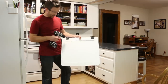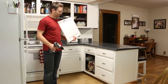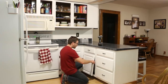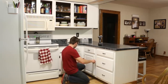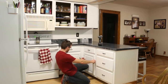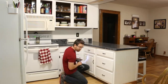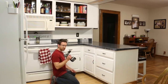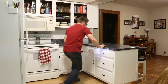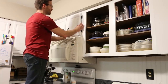Now we're putting on our cabinet doors. Mount the brackets to the door — luckily I was able to use the previous holes, which saves time. I got the handle on there and a couple of little bumpers; it all came from the Amazon link below. To set it on, line it up with the drawer — it goes about a quarter inch up from the rest. It wants to shift right as I tighten it down, so I start a little bit off to the left. Don't over-tighten or you'll strip them out. Clicker secure.